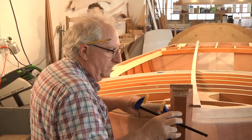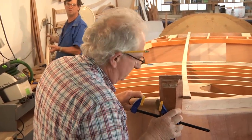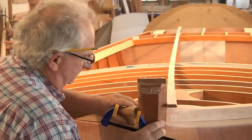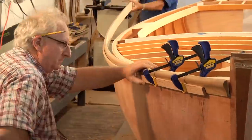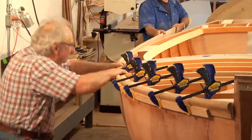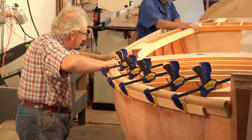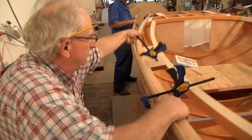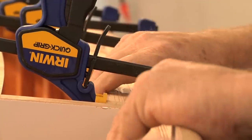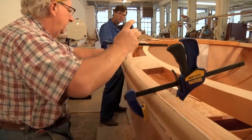The reason we're doing this is to make sure that the shear plank, as it bends, bends nice and fairly into the rebate that it's supposed to sit in and takes a nice shape to it. It really felt like it was bending nicely and evenly, and I think that's all accounting for the very even, tight grain that we have in this piece. It looks like seven-sixteenths — that's what we want.